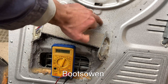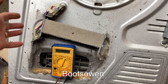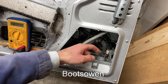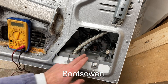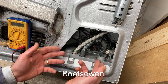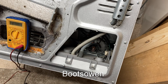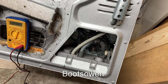What I'm going to do while I have the back off is give it a bit of a vacuum to get the light fluff out. There's no sign of scorching — I've taken apart tumble dryers that are absolutely solid with fluff and look like they've been on fire, so this is relatively clean. At the back there's a little motor cover or pump cover. This is the float switch — when this reservoir fills up with water it pushes up on the switch, which is on a pump that pumps water up to the water drawer. You can prise off these clips to get into it as it can get gunked up. There's the motor, and there should be a capacitor — I think it's in there behind those hoses, bolted onto the bottom. I can't really check that without swapping it out.